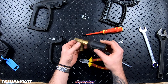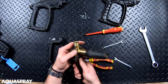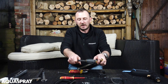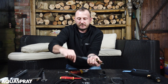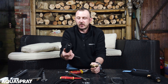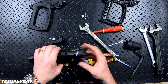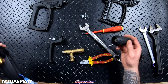That's how the trigger is, and then you can get rid of the rest of the mechanism. Hold the spanner over where the two little brass lugs are and take the front off first. You need a 24mm spanner and a 14mm Allen key. Put a little bit of pressure on and you will unscrew that. So that's a quick release front on it — it's identical to the screw coupling one. This one has a smaller Allen key in the front. You can take that off and it would just bolt straight in there and convert it to a quick release if you wanted to, so it's exactly the same gun.